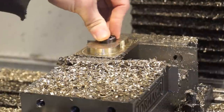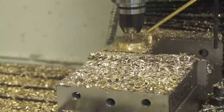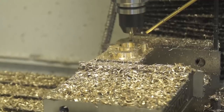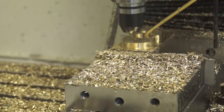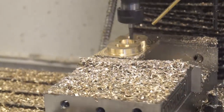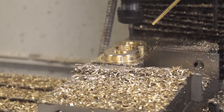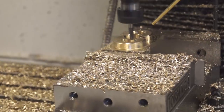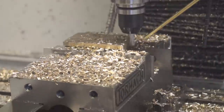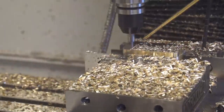I went back in and widened it out a tiny bit, but I didn't film that. So here I am adding these little side holes with a 1/8-inch end mill — again doing a 3D adaptive and then a 2D contour finishing pass to make it pretty. I finished up everything with a chamfer, which I had left the settings a bit too wide from my taste. This chamfer ended up fat — I'm using a ball end mill — it was okay.